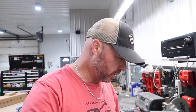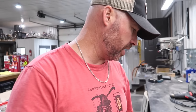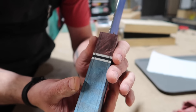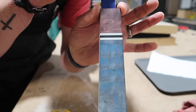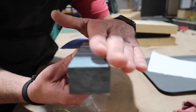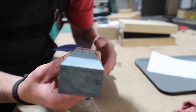So I'm just going to try that — order one of those carbide hammers and give it a shot. But this sliver and this pen knife came out very nicely, as well as the minimalist EDC and that little last-ditch necker. So we're going to get working on those. This other guy — we've marked up some lines — we are going to thin this handle down to just over three-quarters of an inch wide and keep it the same thickness all the way down. It tapers up from here to the butt of the knife — we'll leave that. But when I put in my octagonals on this, instead of 45s, I'm going to bring them in more, so it'll be kind of an ovalized octagonal handle. We'll give it a shot and see if it works.